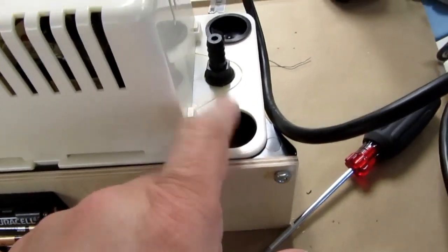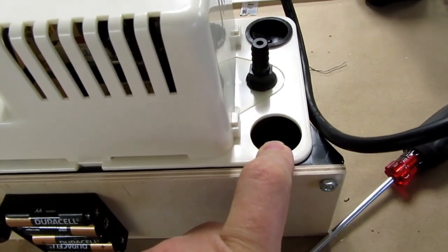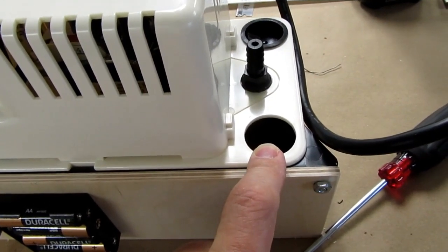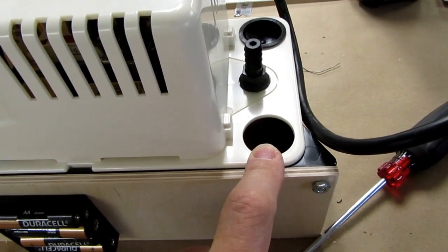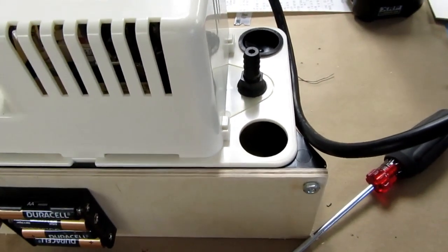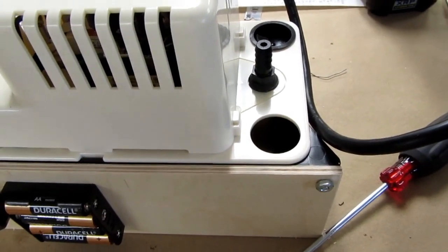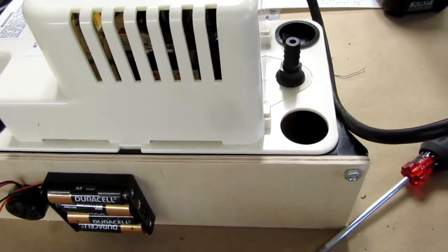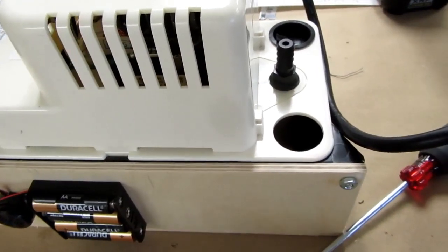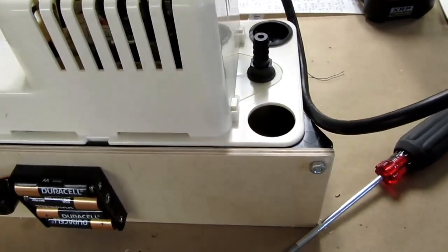And the other thing is, since this is coming from a dehumidifier and not a regular fixed installation air conditioning condenser, which would normally be drained through a PVC pipe, the portable dehumidifier, as most of them do, has a garden hose fitting tucked up under inside above its own tank, and sometimes it'll come out the back, sometimes it comes out through a little hatch on the side. The one that's at my relative's house has a hatch on the side, and then you can run a garden hose or any hose with a garden hose fitting on it in through that hole, and then it screws onto the fitting on the inside of the dehumidifier. And if you don't do that, then the water just runs out the end of that fitting and drops into the tank. That's the way that works.